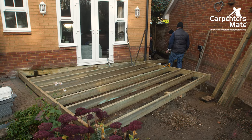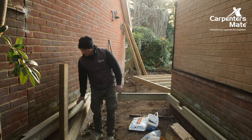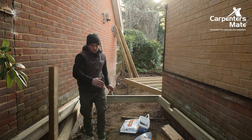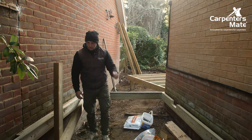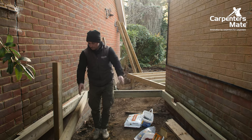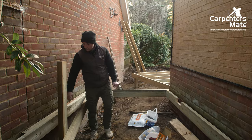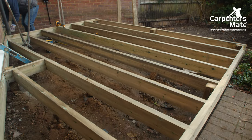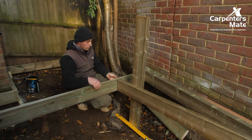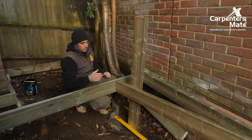For each segment of the deck we're trying to keep it square, and we keep the mitre part separate, which just needs a couple of noggins. That makes all your joists the same size and the same square — you don't have to keep changing the cutter to different angles, and you can run them in either direction. All that's left is to put the smaller pieces in where required. The support timbers are only temporary, but they keep the weight off the screw end and help manoeuvre things into position without the pressure of the whole board.